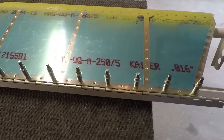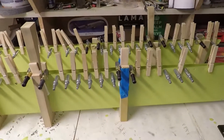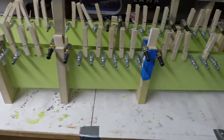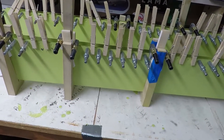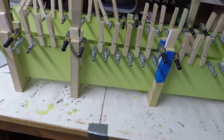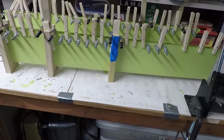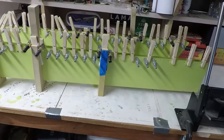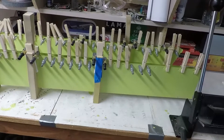So that's where these are at, and fear not, that's not all I've done this week. Over here, these are the actual trim tabs. There are foam ribs under each one of these that are currently gluing — they're using that tank sealant, and they are being squished and compressed into there and held into place. They have to sit for four days, which I'm about to go to work for four days, so that works out quite convenient. They can sit for the next four days and glue themselves up nice and straight.